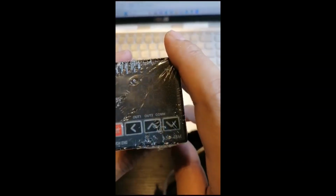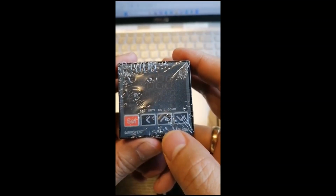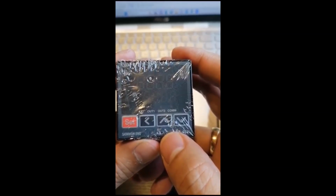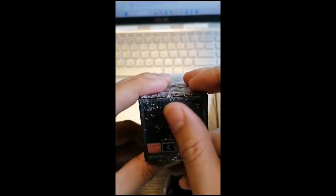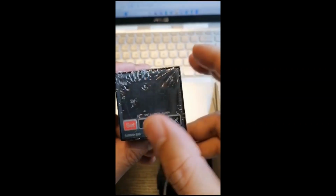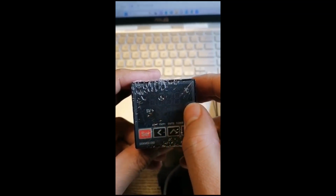So after that, you are going to scale according to the value. For example, 4 to 20 milliamps. What is the value? Mostly, of course, 0. And then the value of your 20, you are going to make it 16. For example, 0 to 16 bar. Then it's going to be displayed from here according to the fluctuation of your 4 to 20 mA. When you apply pressure on your transmitter, you are going to see it from here.